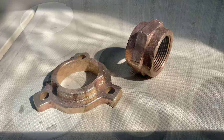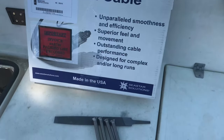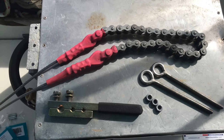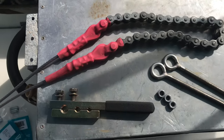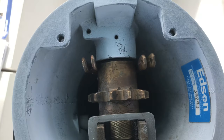I redid the stuffing box. There's the new aluminum-base idler pulley plate, which is a much improved design. I got new clamps, new thimbles, new stainless 7x19 wire, new screws ordered from Edson, and new engine control cables. I crimped the new wire to the old chain, which cleaned up nicely, and followed Edson's website instructions for rebuilding the pedestal — pretty straightforward, came out nice. The brake was in good shape so I left that.